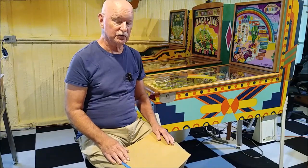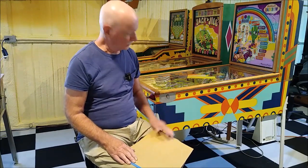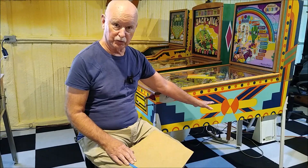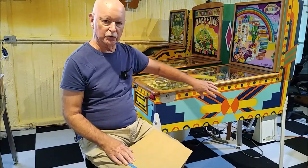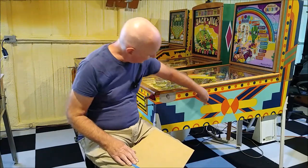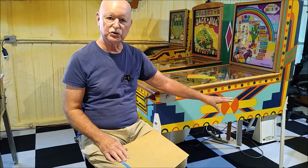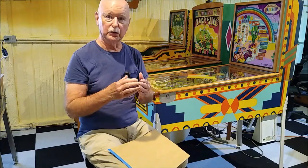This is not necessarily the best way to do it — this is the way that I do it, and it works well for me. It produces excellent results. I do not end up with any mismatch of any of the colors meeting each other. Every shape meets without showing any gap through it into whatever color is underneath. In this case, I have a white primer paint on the cabinet, and then I paint over that. That way all the colors have a consistent white beneath them and they come out a lot better. But if I had any mismatch of my stencil shapes, I would notice a white witness line coming through where the colors and shapes meet. I don't get any of that with this technique — it's essentially foolproof. You're going to get perfect joints every time without doing any extra work.